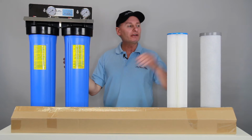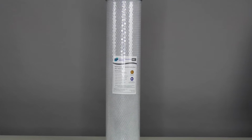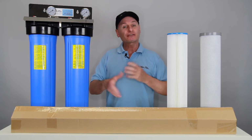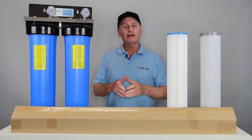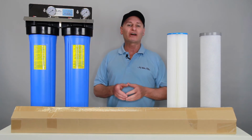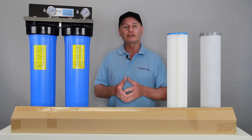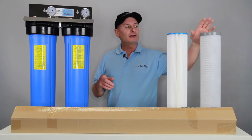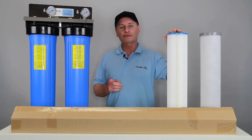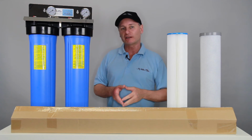After the water flows out of that side of the system, it flows into the second housing here, and that's where we've got the silver impregnated carbon block cartridge. Having the silver in there stops any bacteria growth in the cartridge. They are available in a plain style if you like, but because the water's untreated, that's what we use in that situation. Once again, just to give you our best shot. They're not really washable, but they're well protected by this first cartridge. Normally you'll change those annually, every 12 months or so.